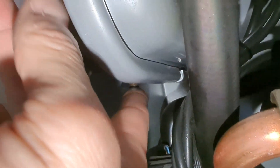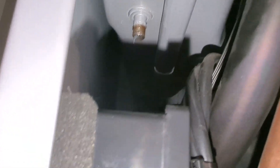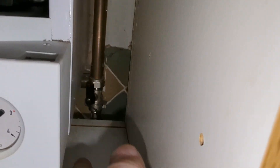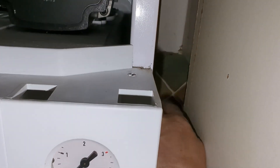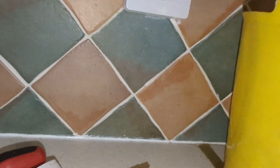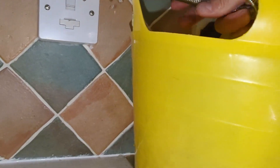A bit of silicone grease — just checking the Schrader valve is not passing at all before we put its cap back on. The expansion vessel is now pumped up and it held at one bar. You can see the pressure on the boiler was still on zero, so we know the expansion vessel charge is correct. We can now reconnect the filling loop.